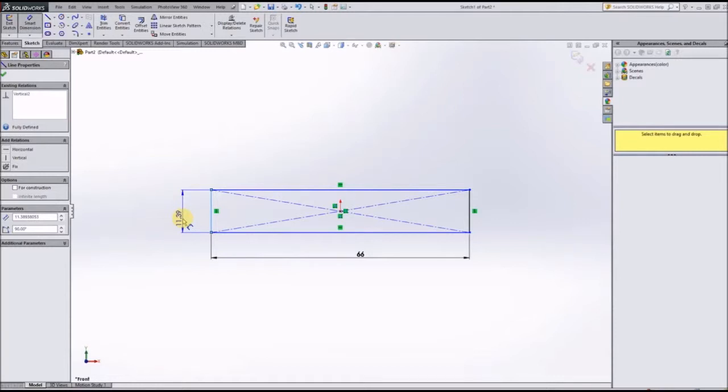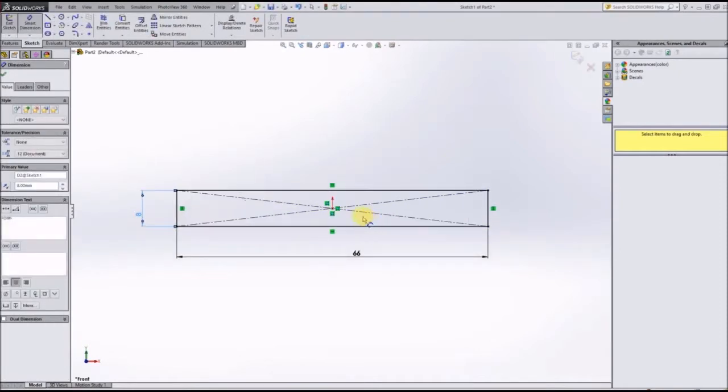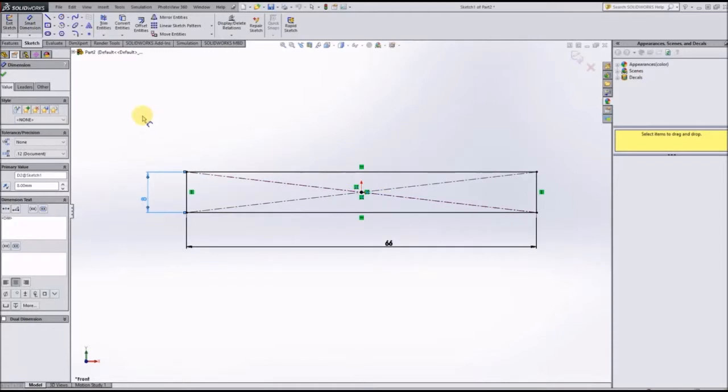And for now, I'm just going to model the bottom half, and I'm going to extrude the top half up off of this bottom half, so it's 8 millimeters thick. Actually, while in this drawing, I will go ahead and make sure that I get that second half up there on the top.